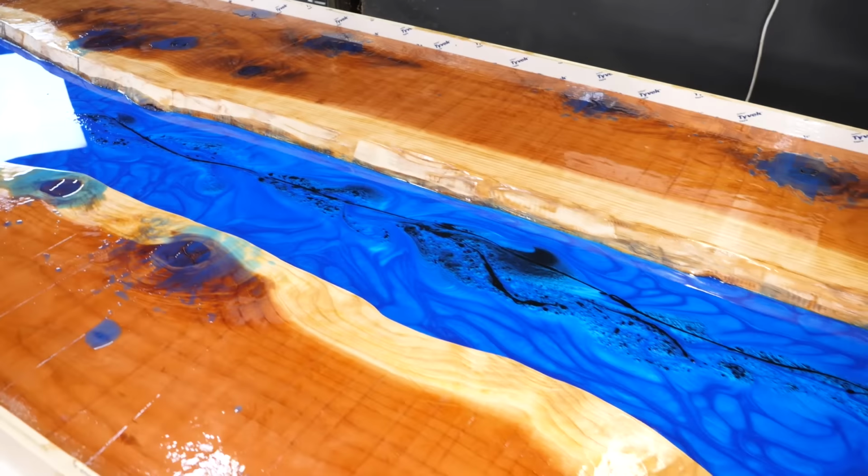Next step here, after chopping that top to remove the trowel lines, is we're going to remove the air with a propane torch. You could also use a heat gun, but the propane torch works best. Ooh la la, look at that bad boy.